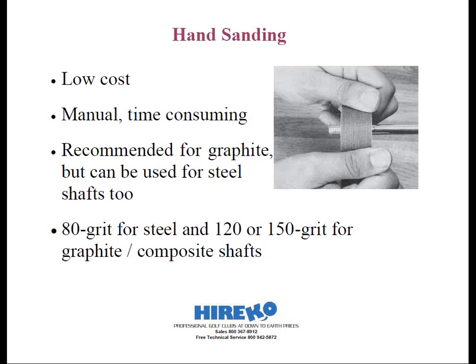You are risking your reputation as a confident club maker if this occurs on a regular basis. Light colored shafts like whites and yellows may have several layers of paint so the black doesn't bleed through. No better example than the yellow colored UST Pro 4 shafts. It was always hard to test these shafts because they had multiple layers of paint on them. When you sand through, it would take like three layers of paint until you got down to the dull charcoal color, just like the butt end of a graphite shaft. That's how you know when you get to the bare shaft itself.